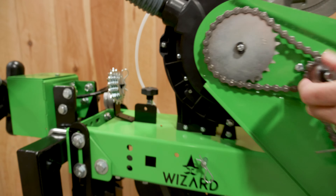If we move the singulator closer it starts knocking them off — we're bumping too many off, so we back it out. And there you go. That's how you can see the vacuum planter working, allowing you to singulate seeds much better than a mechanical system where seeds have to fit perfectly within the plate — otherwise you get doubles or skips, and those are some of the limitations of a mechanical approach.